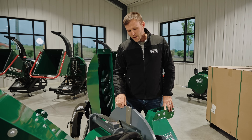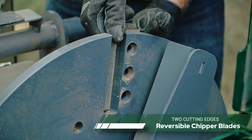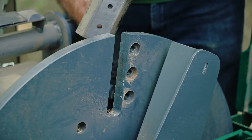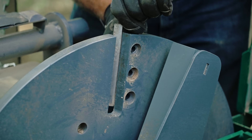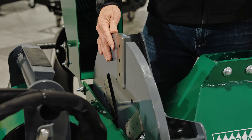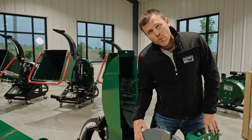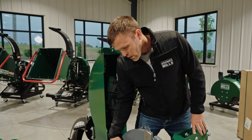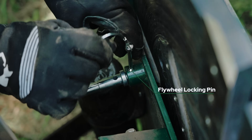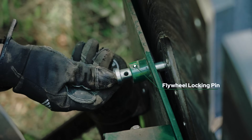Because we have a 1-inch thick flywheel, we've machined in the blades because they're reversible and we want to protect the secondary edge. When you dull the leading edge, you can reverse the blade or flip it — undoing the three bolts and re-torquing — giving you a fresh edge to cut with. When changing the blades, you're going to be using our locking pin to lock out the flywheel's rotation. We've got different locations that let you lock the flywheel for un-torquing and re-torquing the blades, both for safety and for that mechanical lock during torquing.